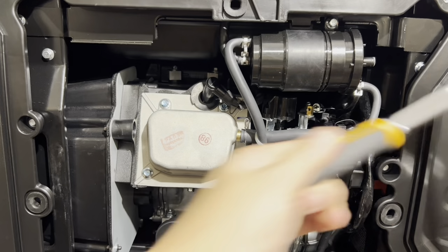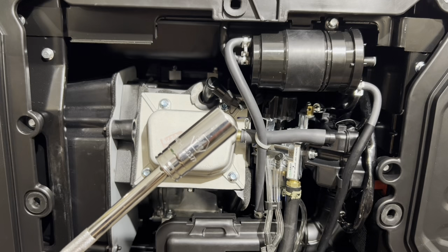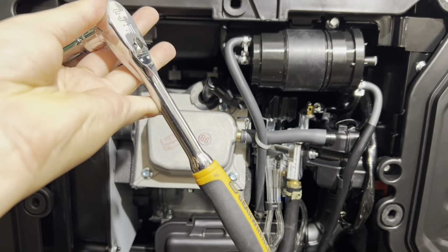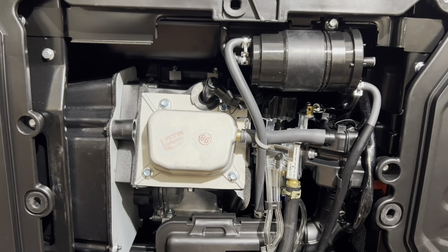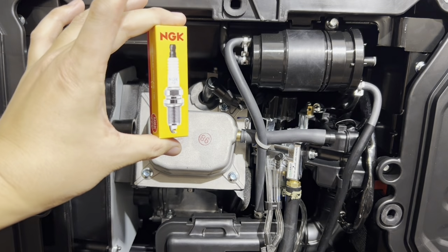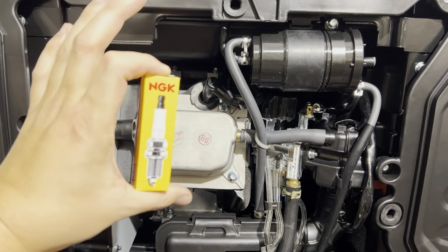So as we remove the spark plug, you again need a 13/16 deep well socket on an extension, on a ratchet. Crack it loose, okay? And when it comes time to gap these spark plugs, it's very important which tool you choose to use to gap the spark plug.